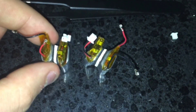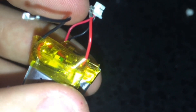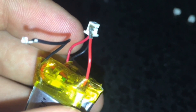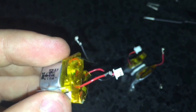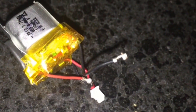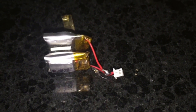At this point we're going to score the red wire right here towards the connector with the soldering gun — just melt it a little bit on the side so we can see the wire. We only did it on one side, just enough to expose the wire. Now take the other connector and open it up slightly with your tweezers — clamp it on right there. Take a dab of solder and solder those two together. Now take the black cable and score it a little bit higher up so that when they're crossing they don't short out. Clamp it on and solder it the same way — that's about how high you want to score it.